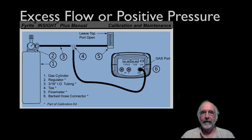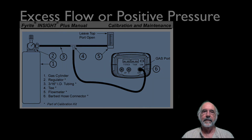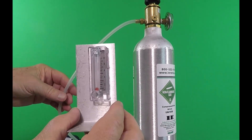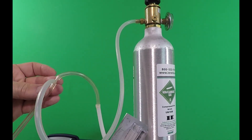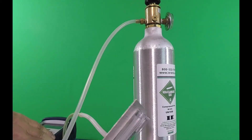I'm going to demonstrate two ways of introducing the cal gas to the instrument that I'm familiar with, and then go into actually how to perform the calibration. One common technique uses a manual regulator and a flow meter — I call it a positive pressure, other people call it the excess flow method. You simply attach the hose to the regulator and go to a T fitting. One leg of the T goes to the flow meter, the other leg goes to the instrument. You turn the knob clockwise until it starts gas flowing as seen by the flow meter.